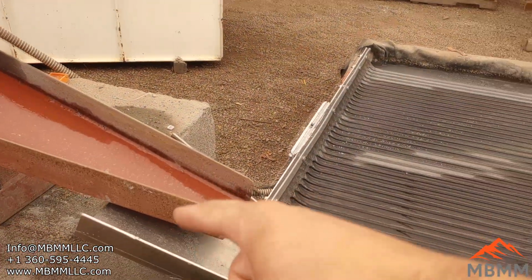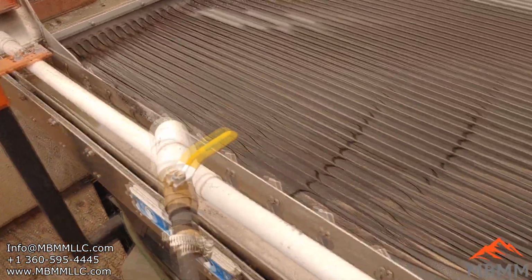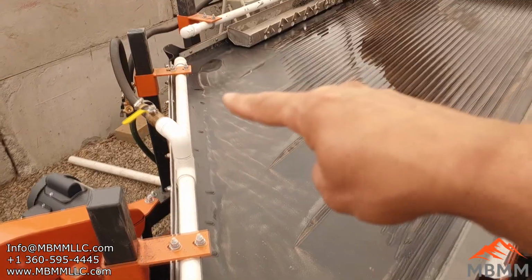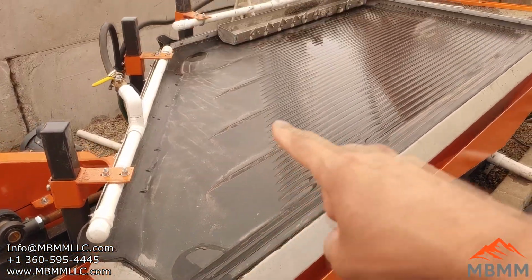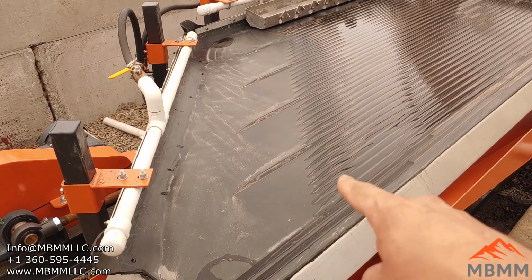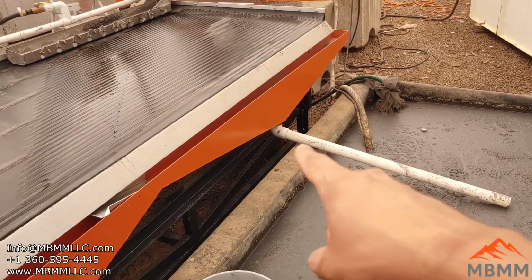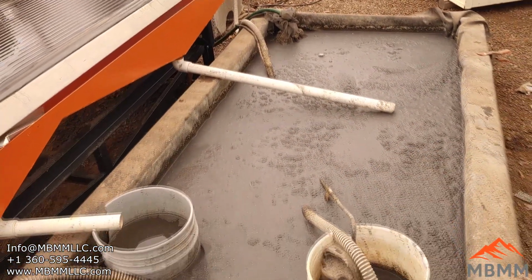We mix it with water and it comes down here onto the shaker table, where all the dense metals will come across these grooves up under the water bar and down into the number 1 and number 2 concentrates. The lighter metals like the aluminum and some of the epoxy are going to come down here into the number 3 middlings. And then the very light plastic and the fiberboard and glass insulation, or the glass fibers, are going to come down here into our settling pond.